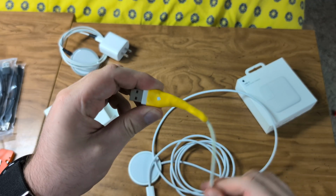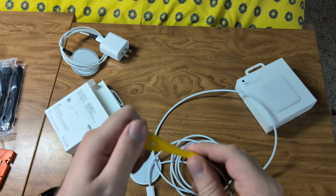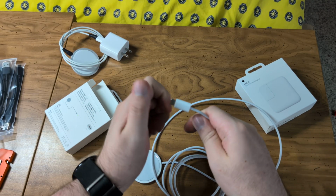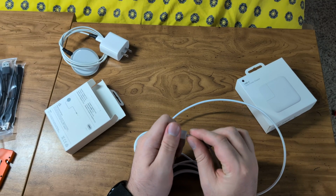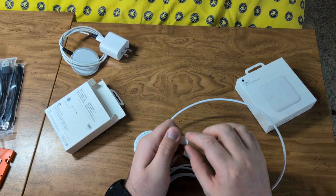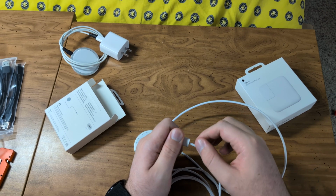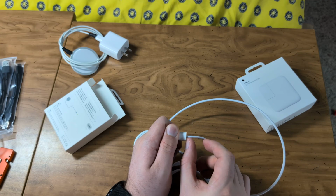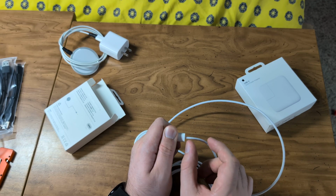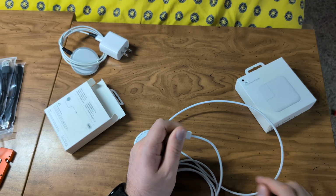And you really want, like I said, you should be holding the connector like this. Imagine going into cases and stuff like that. You need enough recess, so I usually put it half over like this. And you start wrapping, and I go 2 widths of electrical tape. Now, electrical tape is 3/4 of an inch, so that's 1.5 inches down, and then I go back up.